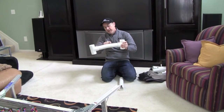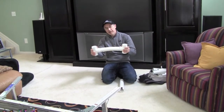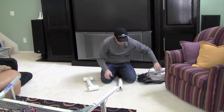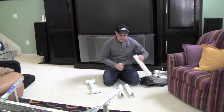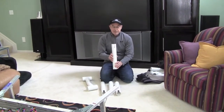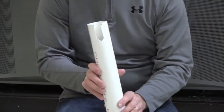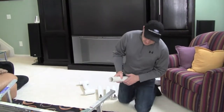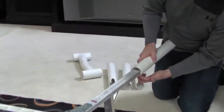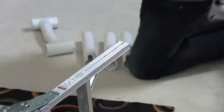To do that, I took a heat gun and carefully warmed the center all the way around until it gets soft, and you can just kind of bend it while it's in place, and then let it cool and it'll stay there. These pieces also have slots in them — I slotted them out by hand with a Dremel tool — because there's a feature on the ladder where there's a brace that this needs to go around. So you'll see how this will kind of nest over there and go all the way up.